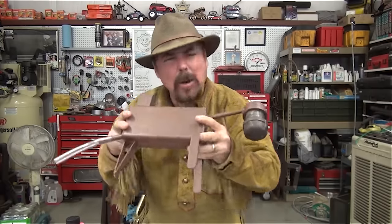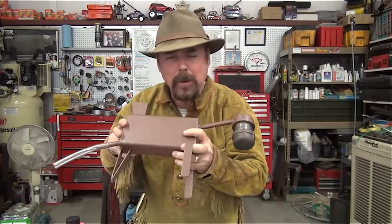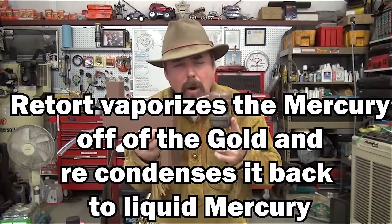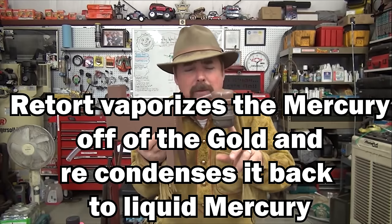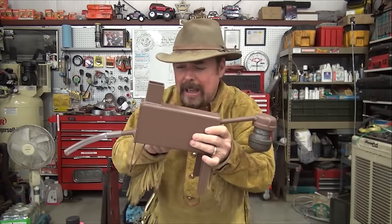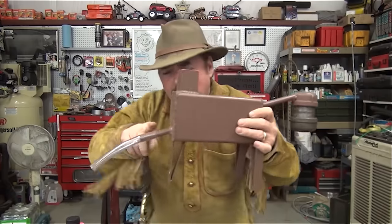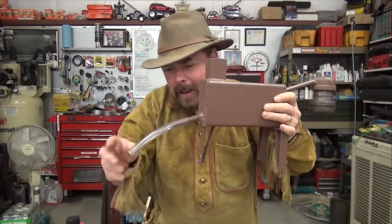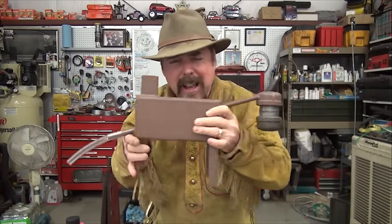The last step is the recovery of the gold out of the amalgam. Remember, when gold and mercury come together they make an amalgam — it's like a ball and it's got mercury all over it. This is a retort. What that means is I'm going to be heating up the mercury and the gold — the amalgam — inside of this little vessel chamber. The vapors go through this water jacket, which is going to be filled with water, and then come out the tail section into a small pan where it's going to be recondensed. So this is like a small still.